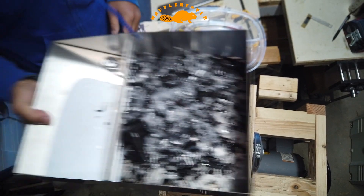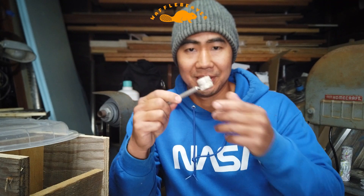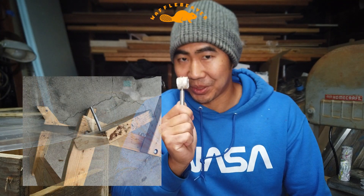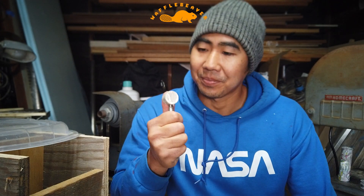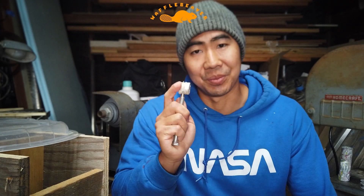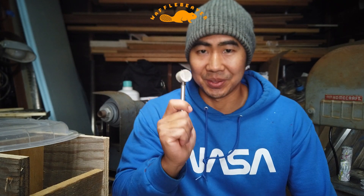I almost forgot to show the results — it does an alright job of shredding. I made these threaded barrel nuts, and you can see a link in the description for how I make them and how I use them to make outdoor furniture, which is really where I see this material being used. It was recently stress-tested because my neighbor hit my bench — luckily it didn't damage the wood; it just pulled out the plastic. I've been using this bench for about six months through the whole hot-and-cold cycle here in California. Interestingly, only the plastic part broke, and it actually helped keep the wood from getting completely damaged — so I see a lot of opportunity in using it as an intentional point of failure.